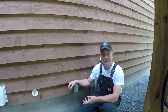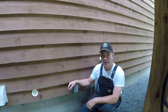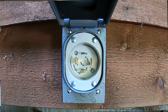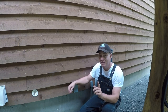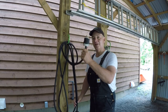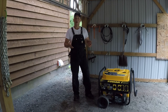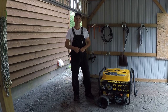You call your local electrician and tell them you want to power your house in the case of an outage with a portable generator. He'll come in and install this rather large plug on the outside of your house, run it to a transfer switch — similar to what I just discussed but not automated — that resides by the hydro panel in your house. He'll make you a length of big heavy-gauge cable with plugs on each end, and you'll head to Lowe's or Home Depot to find a portable generator with enough wattage to power your house.